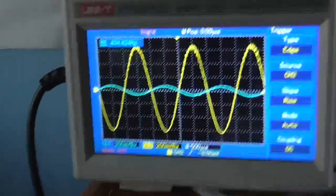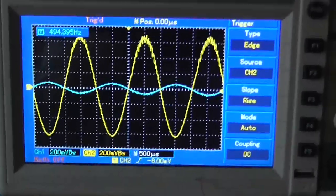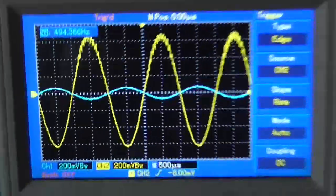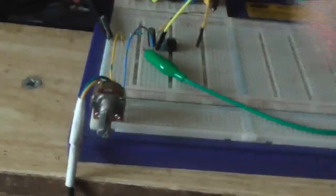Here is the circuit all built up. This variable resistor here is to adjust the amount of input that gets in. I've got the scope hooked up and the computer ready. Let's start the computer playing a tune. And there we are — we have amplification. I've got a little bit of clipping at the top there, but I'm not really too bothered about that. Probably nothing a supply bypass capacitor wouldn't fix. Unless I intend to use this as a headphone amplifier, I'm not too bothered about that anyway. You can see it's definitely inverted.